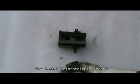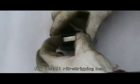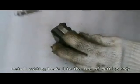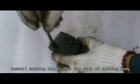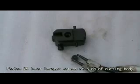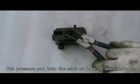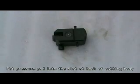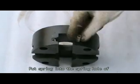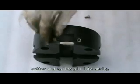Now install rib stripping head. Install cutting blade into slot of cutting body. Fasten M8 inner hexagon screws at the side of cutting body. Put pressure pad into the slot at the back of cutting body. Put spring into the spring hole of cutter and spring pin into spring.